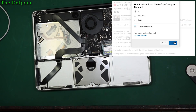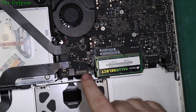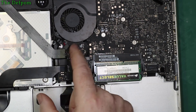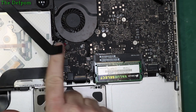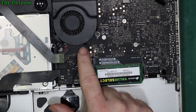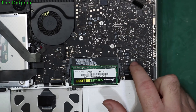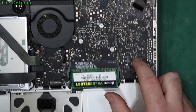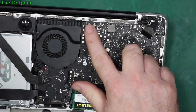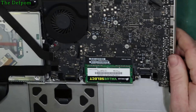As you can see it's got some bits missing and it is liquid damaged. There's liquid damage around this chip here, which is the keyboard controller, and there's actually some over here as well, underneath this connector for the WiFi. There's some corrosion inside the connector itself. That chip there has got corrosion around it, and there's some over here, some there, some up here — over here, which is sensors. So there's all sorts of things going on.